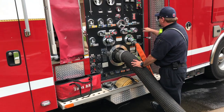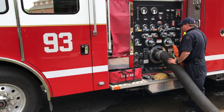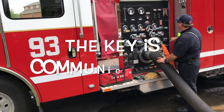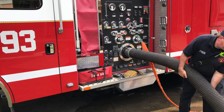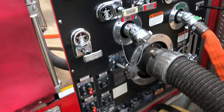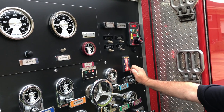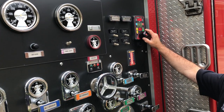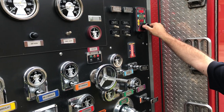The last step is simulating a prime situation where the pump is dry and you need to get water inside the pump. We're going to shut down the supply to the attack engine, communicate with them, let them know we're shutting down water, and make sure both tanks are full. Once that's done, everything gets shut down and you fill the draft using your prime alone. Key point: make sure all your drains are shut. Set your idle to about 1000 RPM and switch to RPM mode — do not stay in pressure mode. Once you have the draft set and you're flowing, then go ahead and put it in pressure mode.